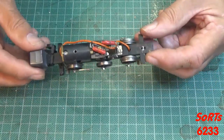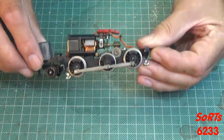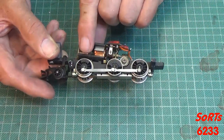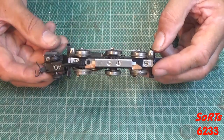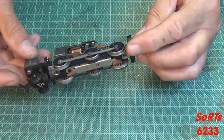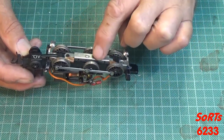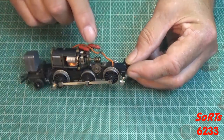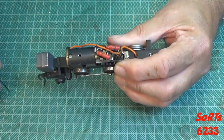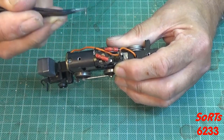There are plenty of bearings that could be lubricated. I'll check out the magnet later on. Deciding on how to progress, I think the mechanism would benefit from a good clean and lubrication, so I'm going to have to strip it down. The motor seems to be secured, I think possibly by a screw underneath from the main chassis, which suggests I might have to release this pickup. The orange wires I presume are from the front and rear shoes. I just noticed something — there's a staple jammed in there that isn't going to help.